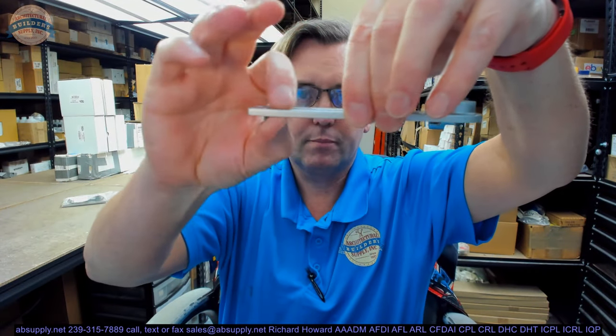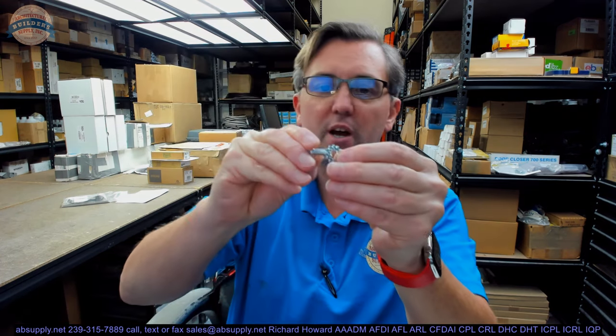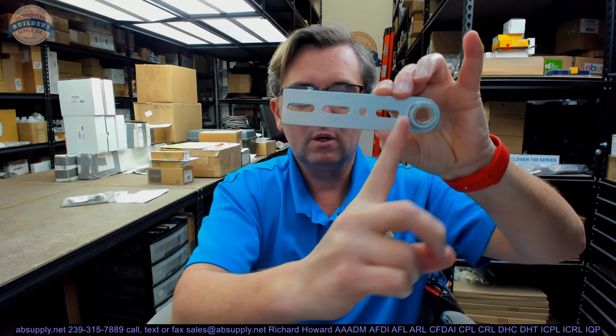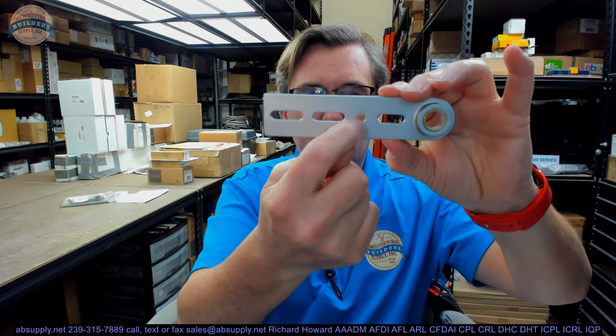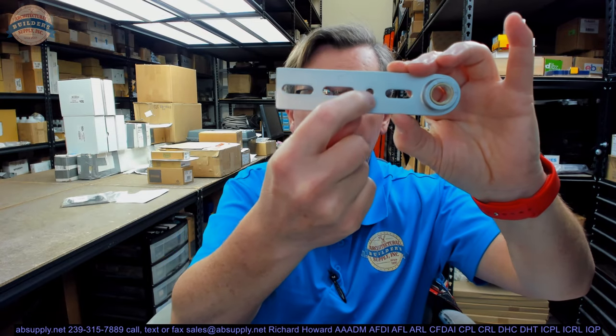So let's take a look at what this actually measures — point one seven eight thick. It's going to include three screws and three star-type washers. Installation of this would put two of those screws through two of the three slotted holes, then once you know you've got the right position on the door, secure that fixed hole to keep it from moving.